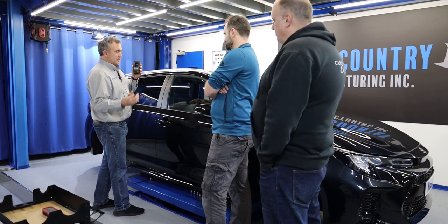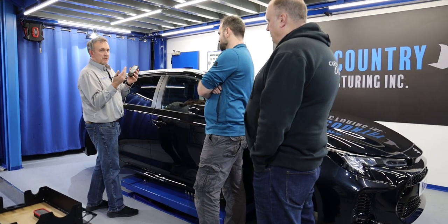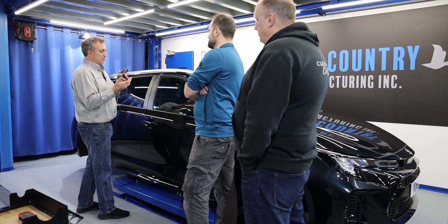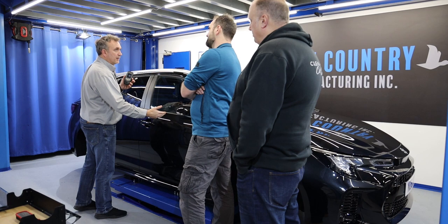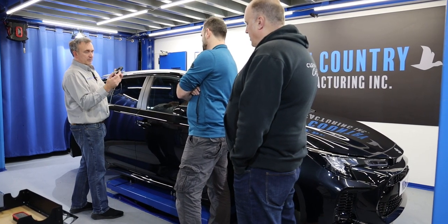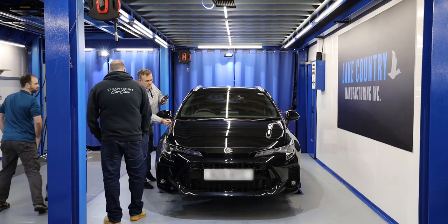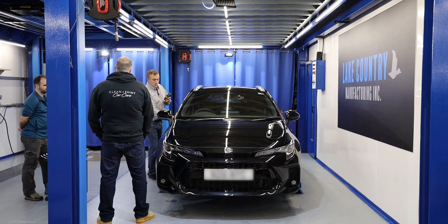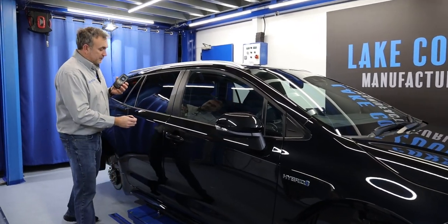It's a good tool, really handy. It doesn't measure the clear coat on top — there's a separate gauge for that. I use a laser light pointer: polish one area, and if you had 128 microns and it now says 126, you've taken two microns of clear coat off. When scanning the vehicle, we're just looking for big changes between one panel and another — that 10 micron difference isn't big enough to flag.